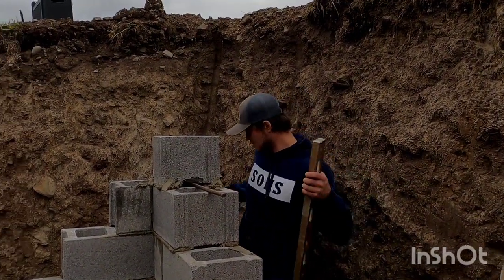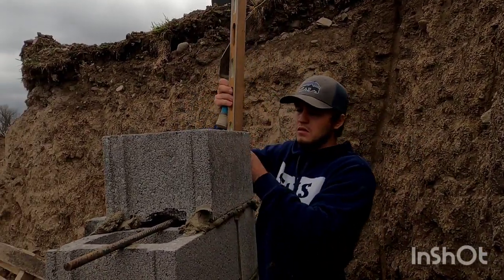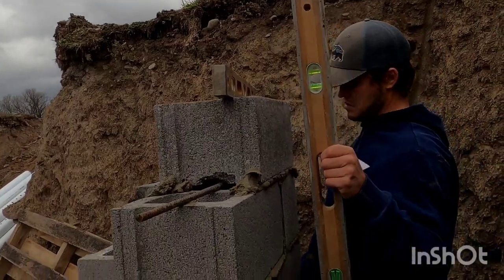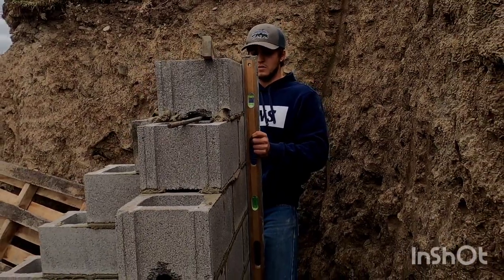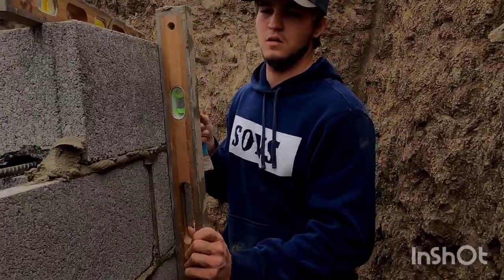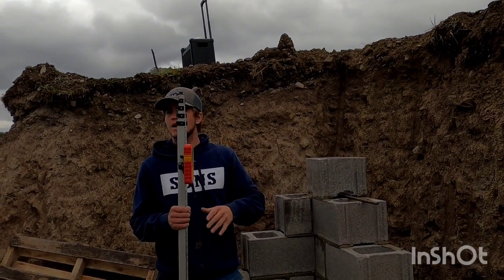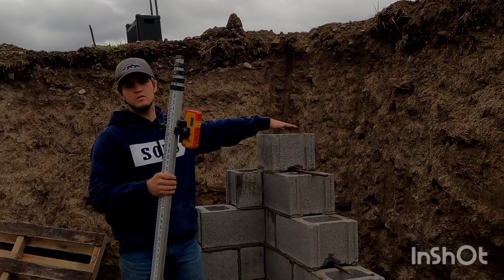All right. So last course here, the only thing you gotta do is plumb the top. And tail down. So if you notice, I got a 4 footer because I want to go as far down as I can. I'm here, tap it in, good, I'm done. So now I just got to make sure that my height is good, and I have an established footer over there, so that's the height that I got to hit for all my leads.